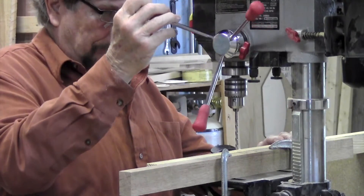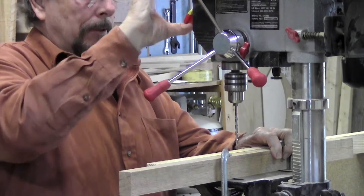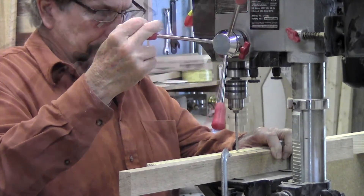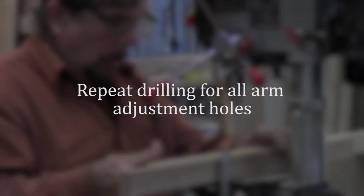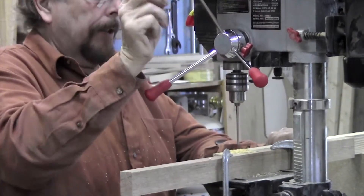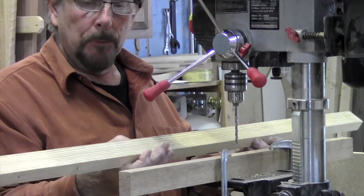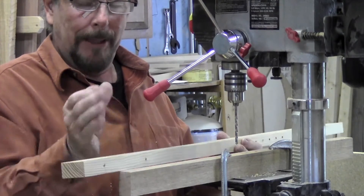Now we're going to drill the holes we just marked — these represent all the attachment points and adjustment holes. We get it lined up with the drill press off, line up that little hole to make sure you're right in the middle where you want to be, then turn on the power. Hole number one. Turning around, we have the two bottom holes that lock the leg piece in place — be particularly accurate with these because they've got to go through the leg piece and all line up perfectly. All the holes are drilled through; now we're ready to move on to the ripping stage, where we rip this board down the middle to make the two separate bow pieces.